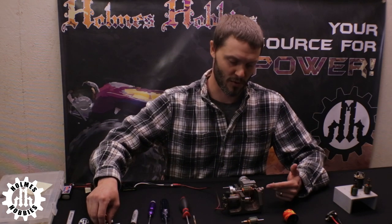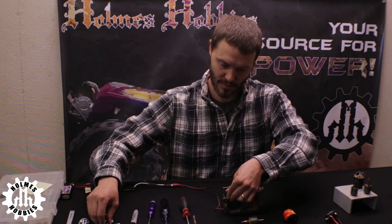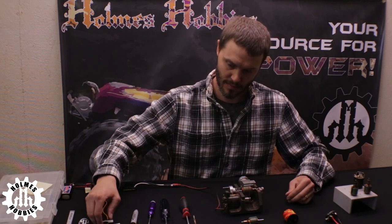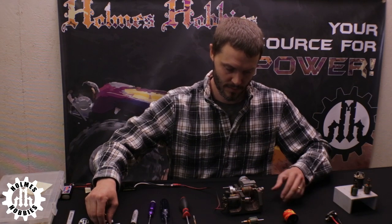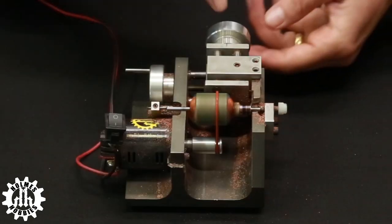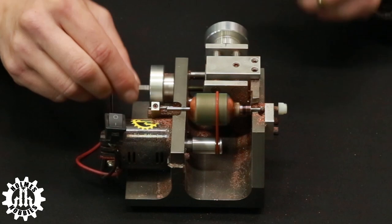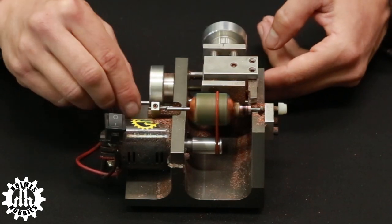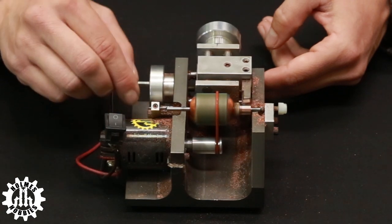Make sure that your armature is spinning in the right direction for the cut of your bit. Advance your lathe just a little bit at a time — one click usually — and take a very thin pass.